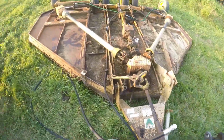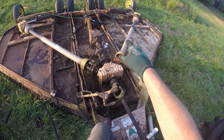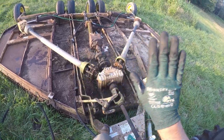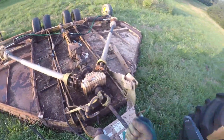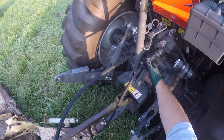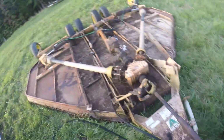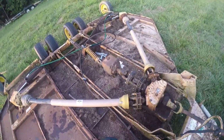So in this case, I just got hydraulics going into one part of the cylinder. So that's going to take the cylinder and really force it up. Gravity is letting the cylinder go down. Some items may actually have force on the cylinder going down as well, so it may be pushing and pulling, and you got force both ways. So that's why you have this right here. But in this case, gravity's letting it go down, hydraulic pressure is raising it up. So for some that may watch YouTube, if I'm wrong in that, let me know in the comments.